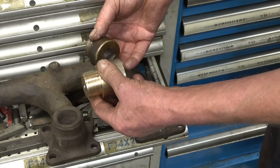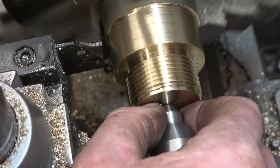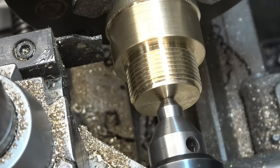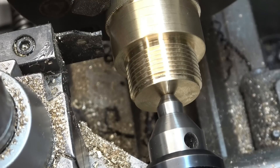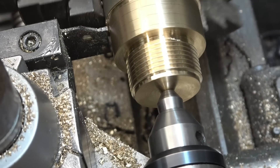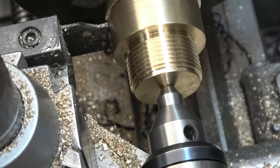I'm going to put a square hole in the back of it now. I'm happy with that, very happy. I've put it back in the chuck, and you can see that by putting the centre in there in the first place, I've actually got it running spot on. So I had to pick that thread up again. I'll do a little video later on showing how you actually pick a thread up in a lathe by using the compound slide, jiggling things around to get it to start again. It's something that's worth being able to do, because quite often you machine a thread, you take it out to try it in the job and the bastard's too tight. Now you can't always put a test piece onto the actual job.